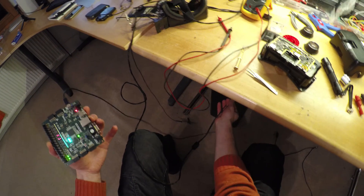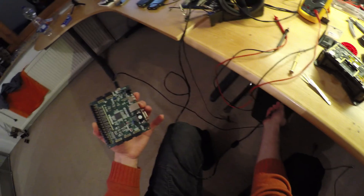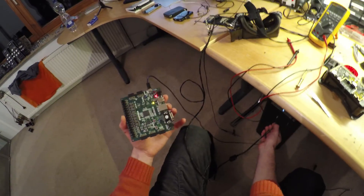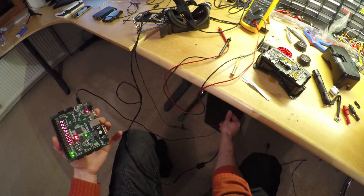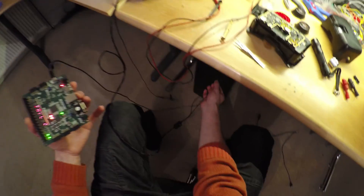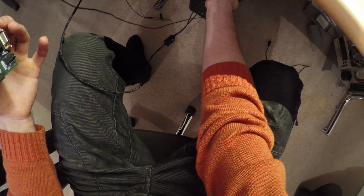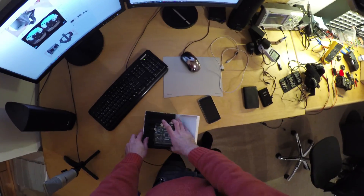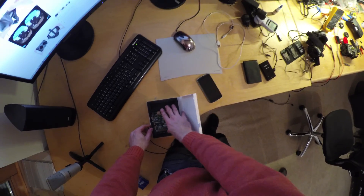To demonstrate that that behavior is abnormal, I connected something like an FPGA demo board with many colorful LEDs to my USB port, and when I plugged in the defective, probably shorted USB cable, the LED light show shut down. I did that because the next step involved something like a leap of faith, because we had to literally crack open the little intermediate box in the USB cable — and that's going to be destructive because the box is sealed with an ultrasonic weld.